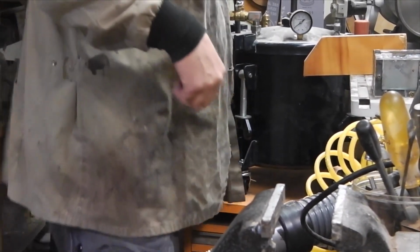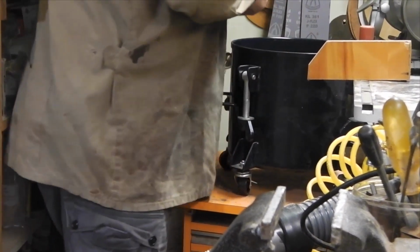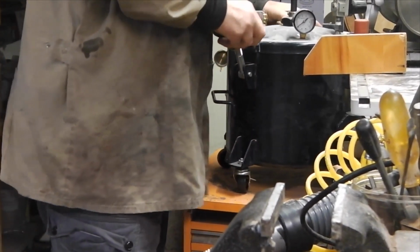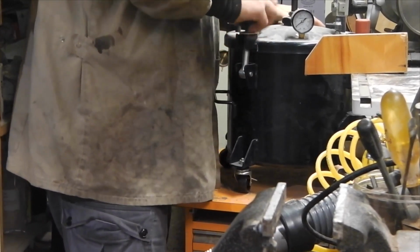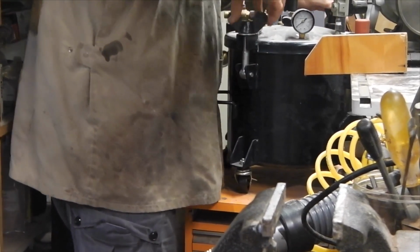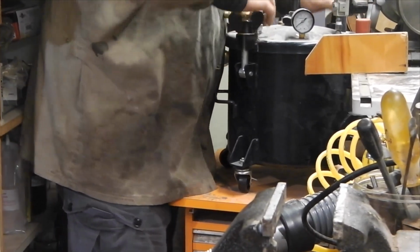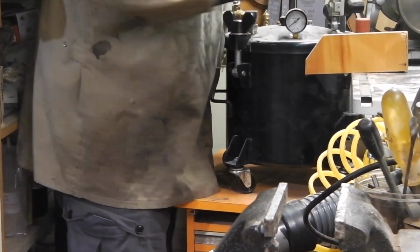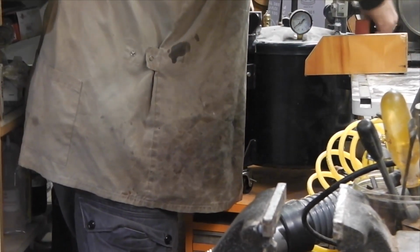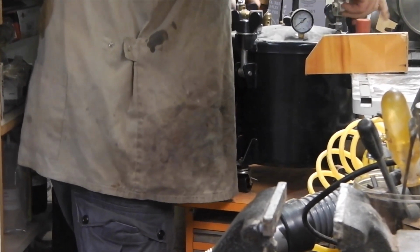You can see my pressure pot, which is really just an old painter's spray pot. You put the mold inside. Screw down the ears here. Although that 7 minutes seems like a long time, it always takes you longer to get things set up than you think it's going to. So you need to have everything pretty much ready to go when you put that Alumilite into the mold.